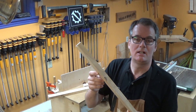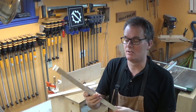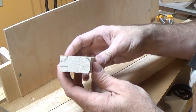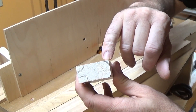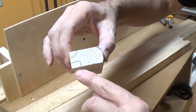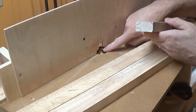So I'm working with some hardwood that I reclaimed from a trashed Ikea table — I believe it's a kind of European beech or something like that. With the paint planed off it looks pretty nice. I have a rectangular piece of wood here; I could make a simple square frame but I want to fancy it up a bit. I've marked on the ends — I'm going to round over the outside, cut a cove on the inside, and cut out a notch where the plaque itself will fit. This is all going to be done on the router table.